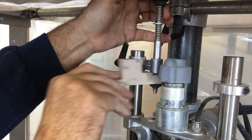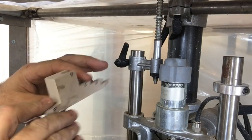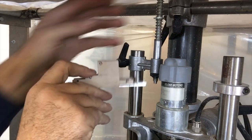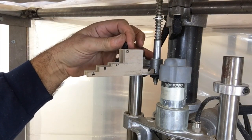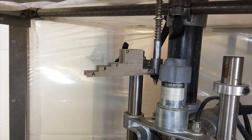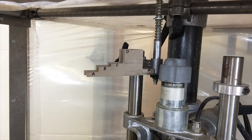And then I can just keep stepping from one to the next and sequentially change all the different stopping positions in a kind of an analog way, if you will. But then I've got a work instruction drawn out for myself that tells me what the pin position is and what the depth position is per the key for each feature on the main well that I make.